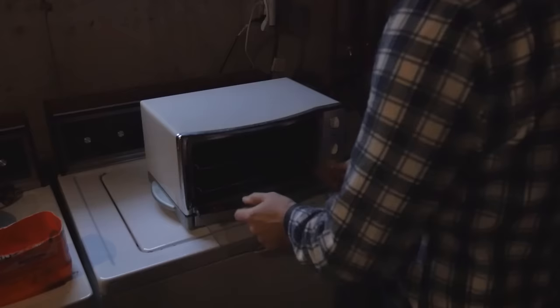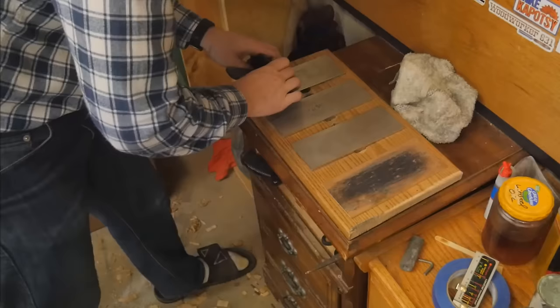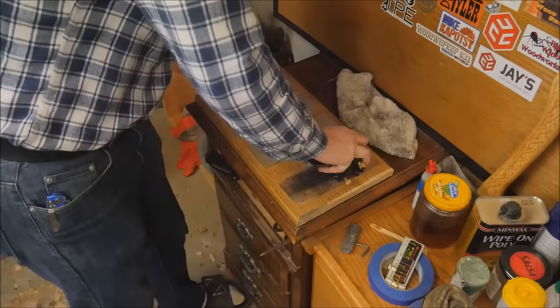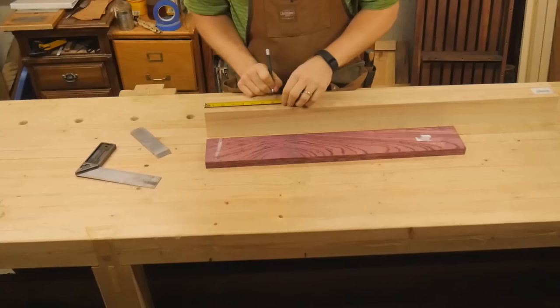Next up, I need to temper it. I put it in this little oven at 420 degrees — I have a specific thermometer to check that — and I put it there for about two hours, then slowly bring it back down to room temperature over the course of an hour to two hours. Then sharpening is just like anything else: go from your smaller grits to your higher grits, and then finish it off on the strop. A very important step just to make sure that everything is perfectly smooth and sharp.